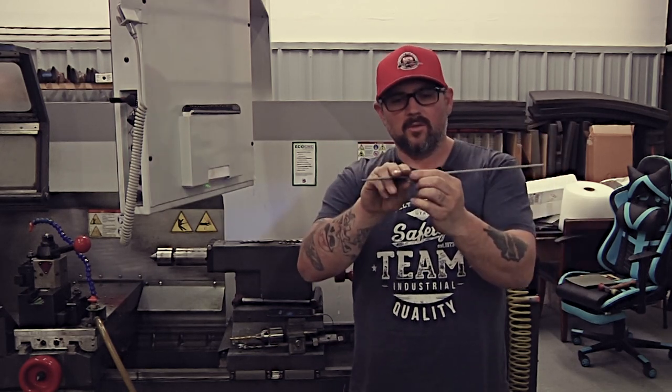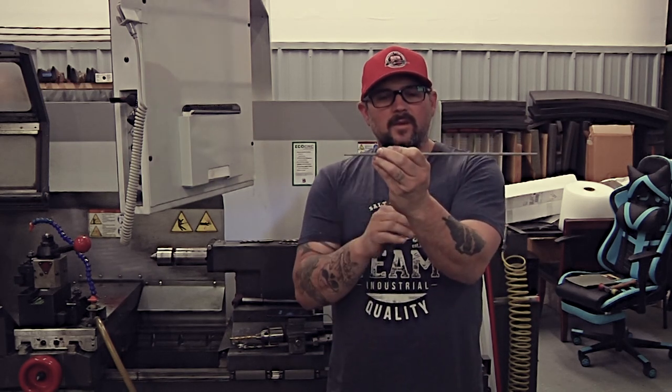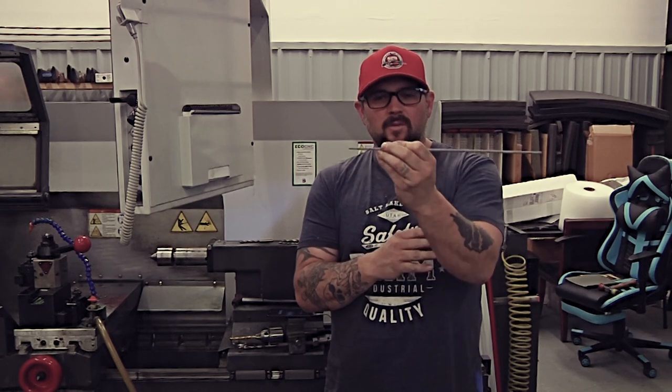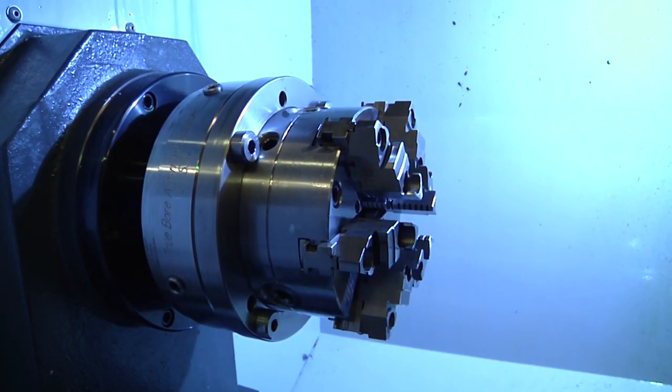What we do is we're holding the barrel only by the first 2 inches of the shank. The head that we're using allows us to tilt and pan as well as adjust our radial runouts at the same time. And what this does is it keeps us from flexing the barrel.